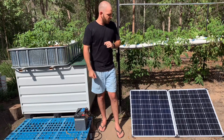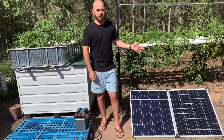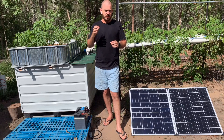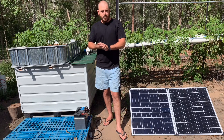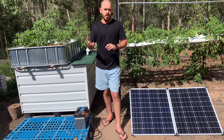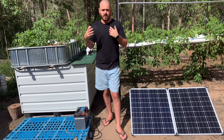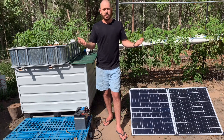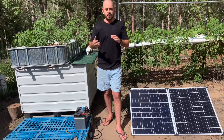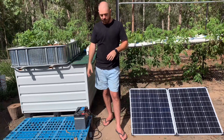I'm running a 90 amp-hour battery here with what was sold to me as a 300-watt solar panel, which I know is pretty much only a 200-watt max solar panel. The pumps I'm running are 12 volts and 13 watts, which roughly equals one amp per pump. So if I have two pumps running on a 90 amp-hour battery, I can reasonably expect 45 hours of runtime. But add in the solar and you pretty much extend that indefinitely, as long as you don't have an extended period without sun. These pumps are very efficient, so you can get away with a smaller battery and a smaller solar system than this.